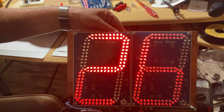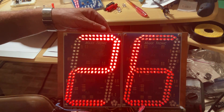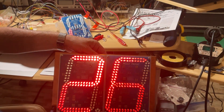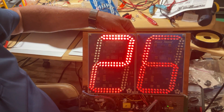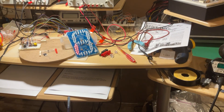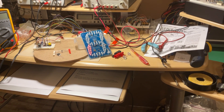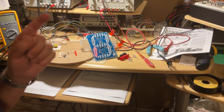If you want to see something even bigger, take a look at any gas pump display — those are 16 inches high. Imagine how many LEDs per segment that requires! So the number of lights per segment depends on the size. In order to manage a display made of many LEDs, we need to understand how LEDs work, and now we're going to focus on one single diode.